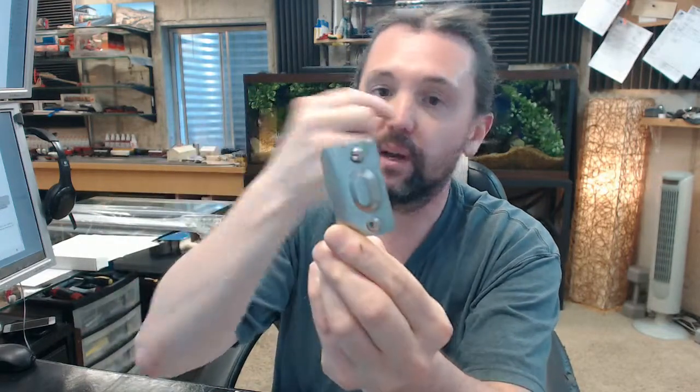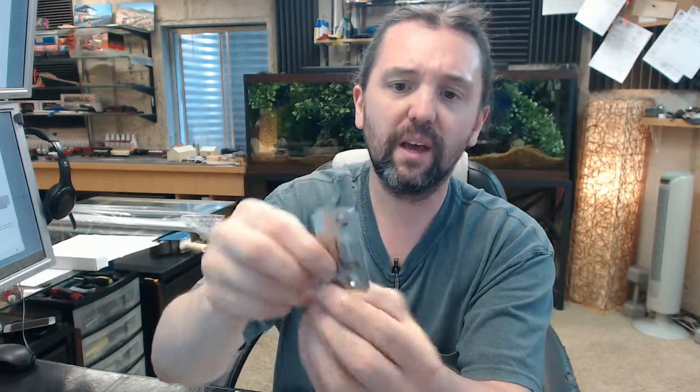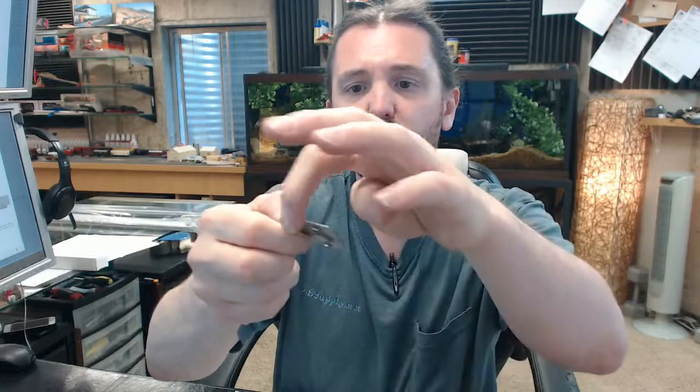Now, mortising for this, I would prefer to use a router in every instance that I could. If I was only doing 1 or 2 of these and I didn't have a template made, I would just use a hammer and chisel. Regardless, I would do a body preparation just for this dimpled area, and obviously the small area for the countersink of the screws. I might use maybe a 1/2 inch Forstner bit and make a couple of small holes there, and make clearance for this, and then I would route my plate.